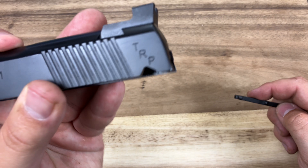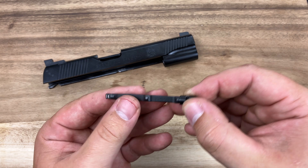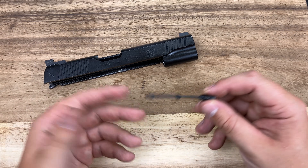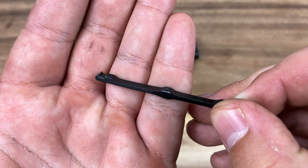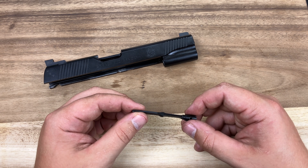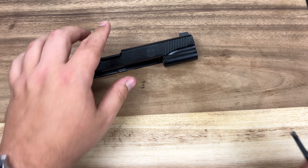The Springfield TRP — the totally rad pistol. This gun still has its original extractor, marked 462, which identifies it to its own parts. It's in pretty good shape. After I bought the gun and did some testing, I did have extractor issues where it wasn't tensioned enough, so we did some quick tensioning and it works fine. You can see a little bit of the extractor claw and bevel in the white — that was either done by Springfield or a previous owner, because I've never had any issues with controlled feeding in this gun. It just needed some tensioning as it was failing the 10-8 extractor test.